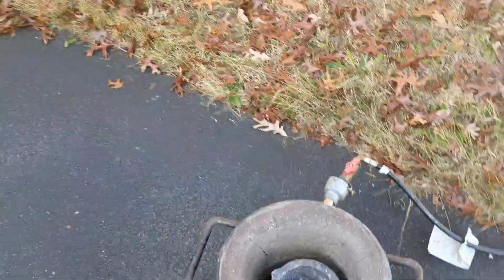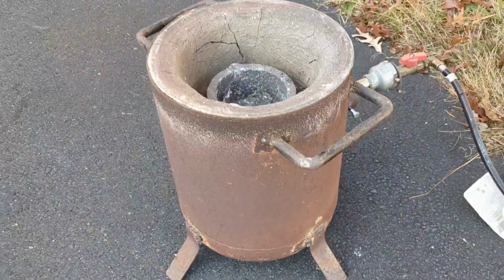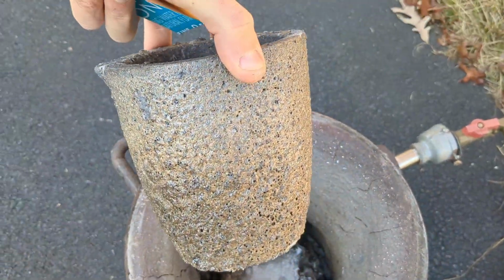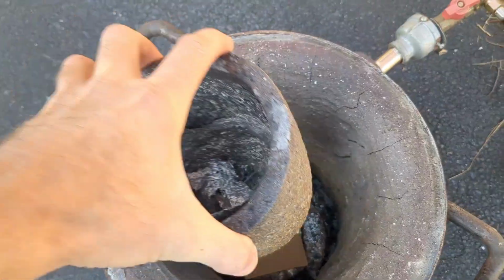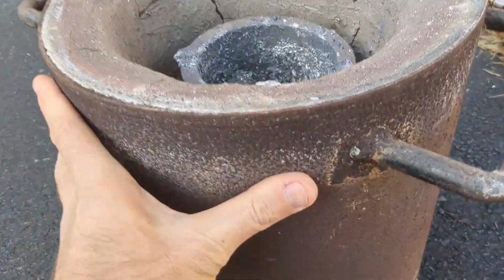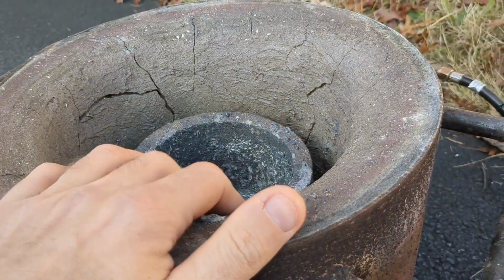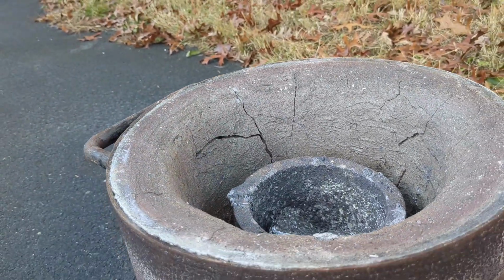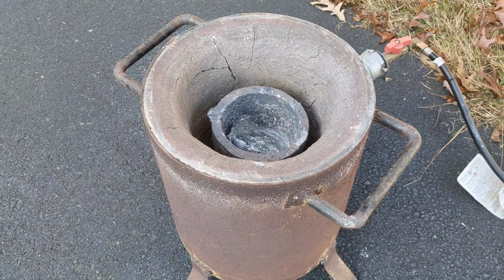Alright guys, so I did decide I'm going to use my furnace that I made when I first started melting metal. So this is a bigger crucible, and it is a bigger furnace. So I'm just going to put a piece of cardboard down here so the crucible doesn't stick to the block down there. And this is an old propane tank. You can see how thick it is here, with some casting plaster on the inside surrounding some Kaowool. I do have an older video explaining how I made this. If you're interested, I'll leave a link in the description.